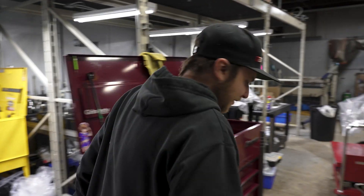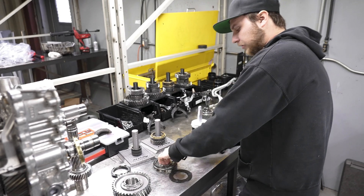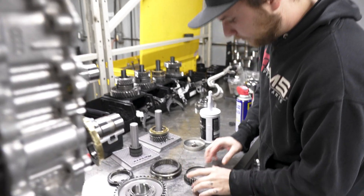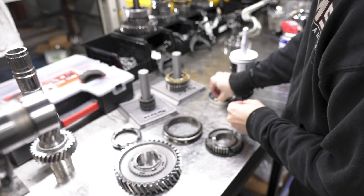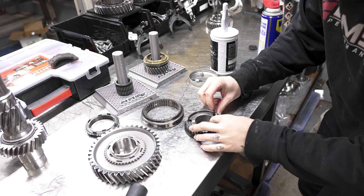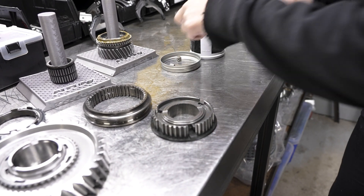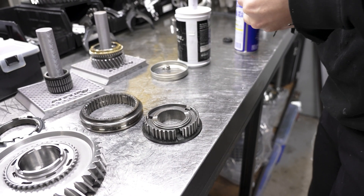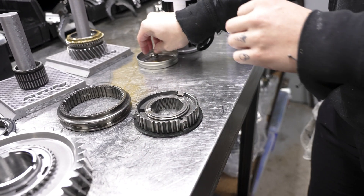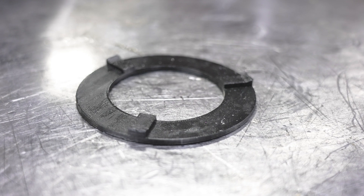I've never had to do this before - these are kind of a little bit of a pain to put back together. So we actually internally 3D printed a little tool to do it. It takes the center hub, and then you've got all these small components that are spring-loaded, so if any of these collars go, things just kind of yard-sale everywhere. So what we did is we 3D printed this little piece that has a little step to kind of hold everything in place - not under a lot of tension, but just enough so the parts aren't falling out.